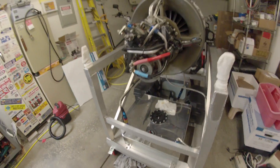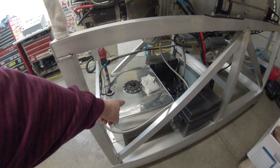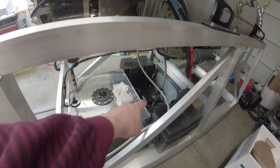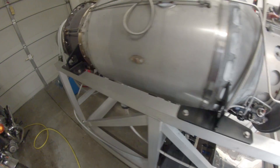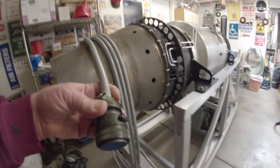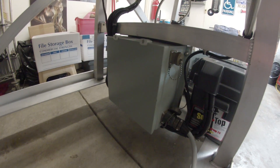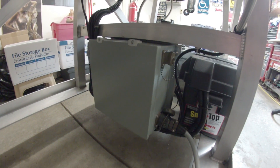The stand is fairly simple but elegant, made out of aluminum. We have a 15-gallon fuel cell, two batteries providing a 24-volt system, and a fuel boost pump that pumps fuel from the tank up to the engine. The engine itself is installed on custom motor mounts that Mark made to fit. There's also a military-style cannon connector that attaches the control console to the electrical cabinet enclosure, which contains relays, breakers, and a starter solenoid.